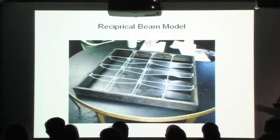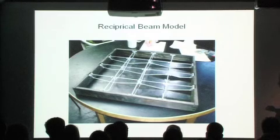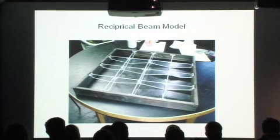Yeah. In fact, flat plate material is quite nice. You can also profile it. If you want to make a really funny up and down surface here, or here, or underside, you just get the flat plate and cut it on a CNC machine to the shape that you want, top and bottom. You then need to clad it, obviously, in something, so that's another type of problem. But you could get the basic framework for a surface which was not flat, very simply, very easily.